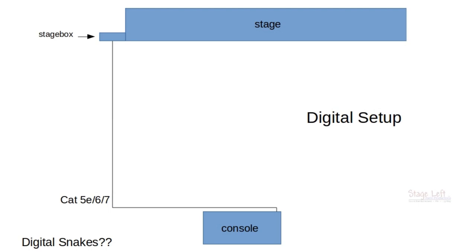If you're a band, you may not need a lot of what we're going to go over. But if you are a sound provider, you're probably going to need most of what is discussed here. So here we have the stage box. For a 32-channel board, we had one stage box set up there, which handles 16 inputs. But actually, what we need are two stage boxes at the stage — that's to handle the full 32 channels in case we need it.